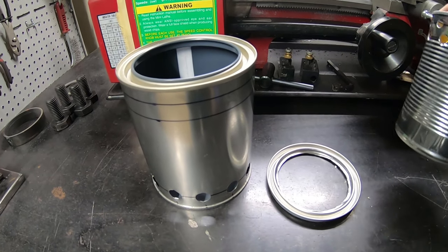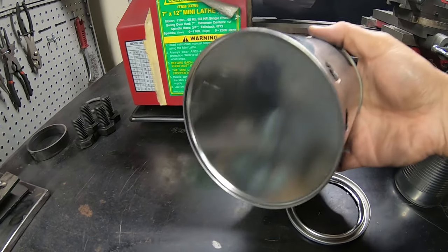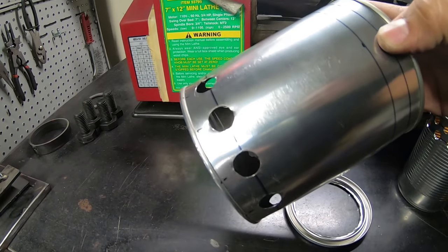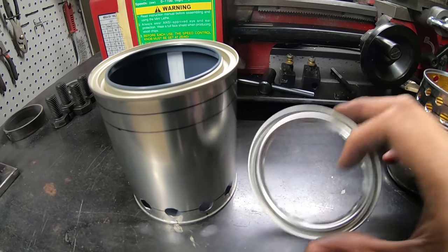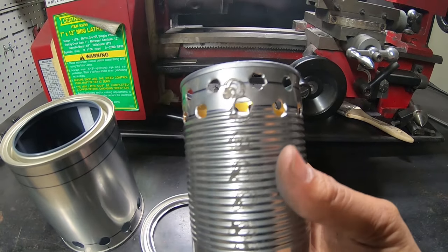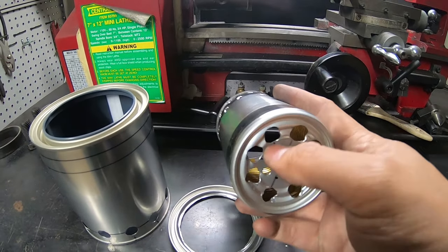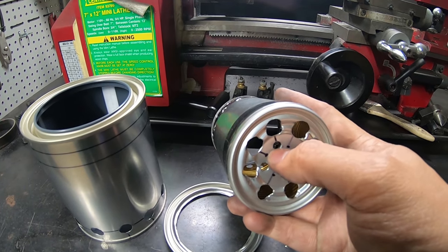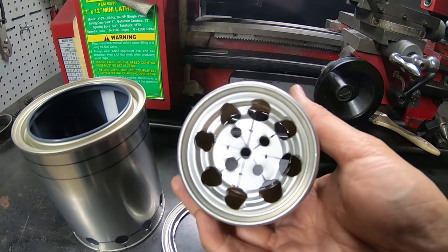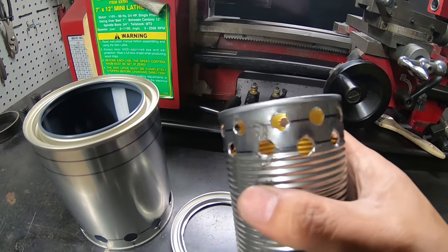Alright, so we're all done cutting everything, drilling everything. Let's see how it fits together. This is the paint can from Home Depot — it's four and a quarter inches in diameter. Basically I left the bottom in place and drilled a bunch of half-inch holes around the base. I think there are 12 of them. This was the lid, so I went ahead and cut this out on the lathe and then cut it to dimensions so that the can could fit in here. This is just a regular old tomato can, as you saw earlier. I went ahead and drilled a bunch of holes in the bottom — I think these are 5/16ths and these are quarter-inch, if I remember right. You can see they're just some holes drilled in a star pattern.